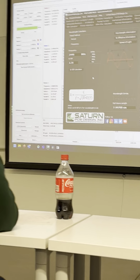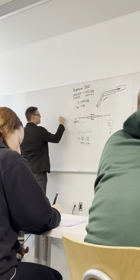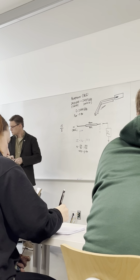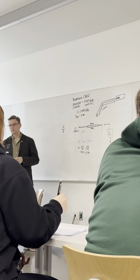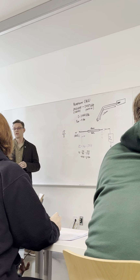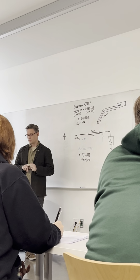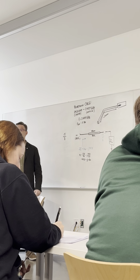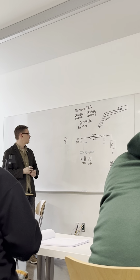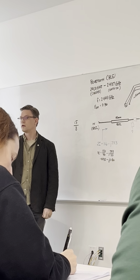So what is 1.5 divided by 8? Less than 25%. I want to say 25% is still more than enough to have to compensate. Remember, 25% of a wavelength is halfway around the Smith chart. Sorry, where'd you get the 1.5? 15 millimeters, 8 centimeters. Oh. I think it's 18.5%,